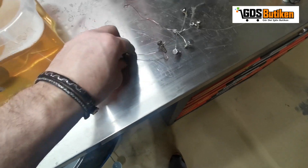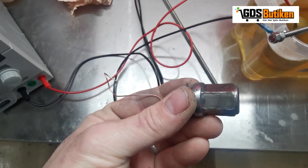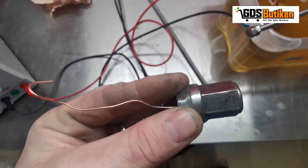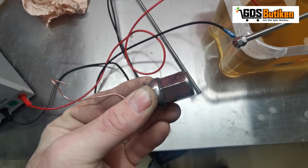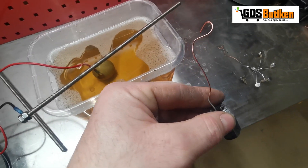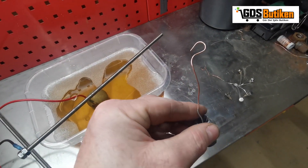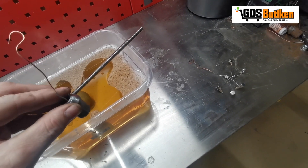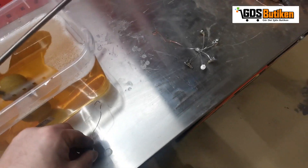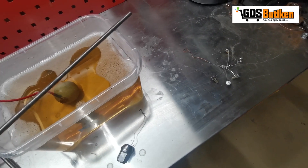All we've done with them is take a wire brush and clean them up, made them all nice and shiny so the zinc will sit better. We've done the same as best we can with the wheel nut — we'll never get rid of all the dents and marks, but we've got rid of a lot of the rust. What needs to happen now is the copper wire from each part needs to be in contact with the rod, so I'll hang them from the copper wire and turn the power on.